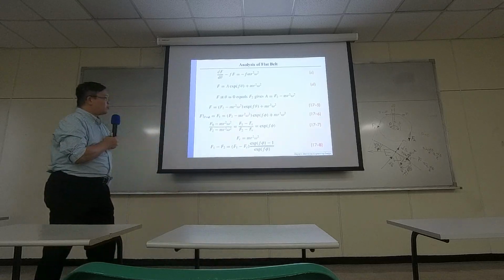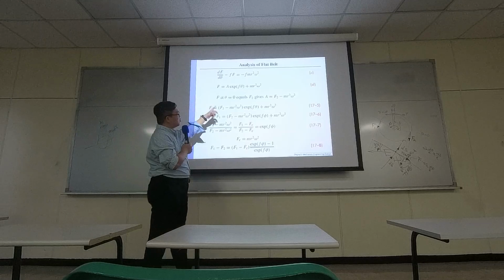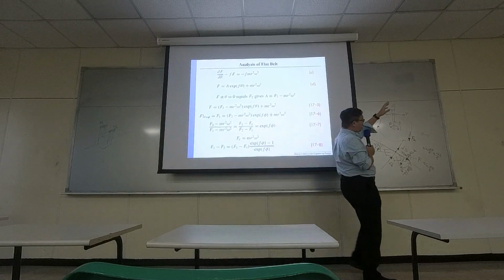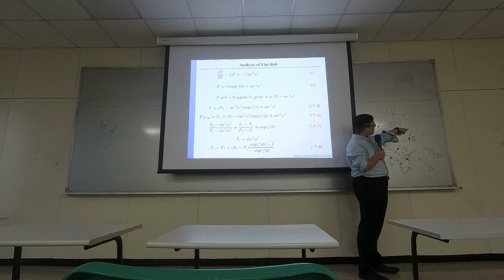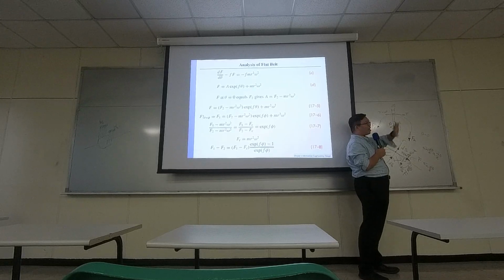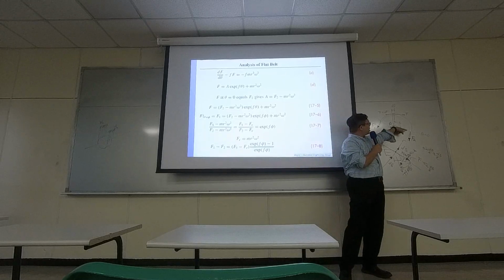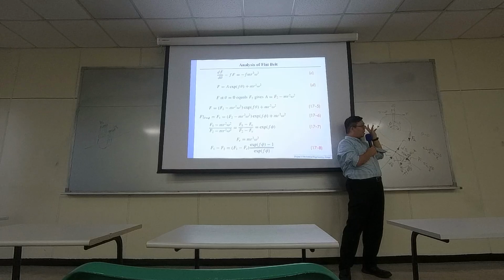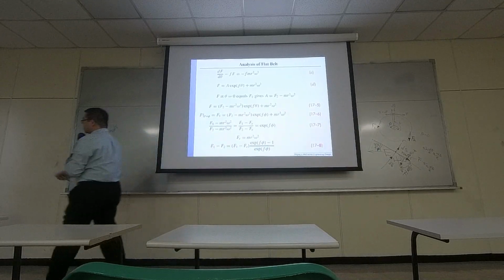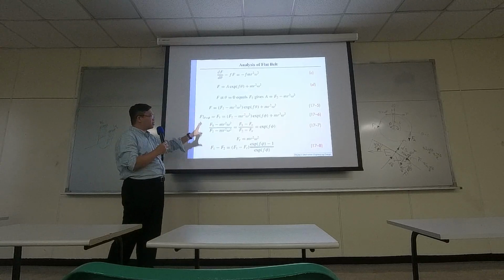Okay? So now you can actually compute the tension forces everywhere, because all you need to do is apply a certain angle. So when theta is 0, you have the tension force F2 right here, and if you investigate anywhere along this arc at any theta, you just need to plug the angle theta into the equation. You will get the tension force anywhere. And if you reach the other tension point, the angle at this condition will be phi. Then you will have F1.